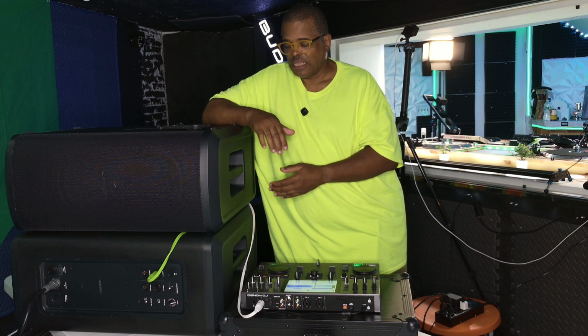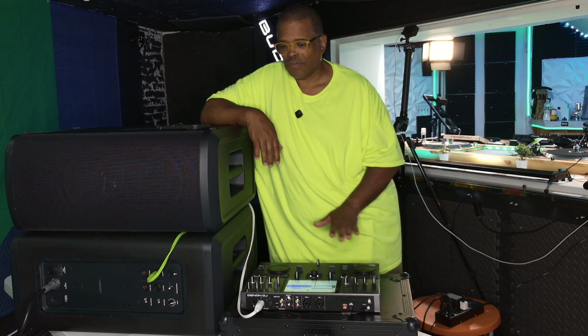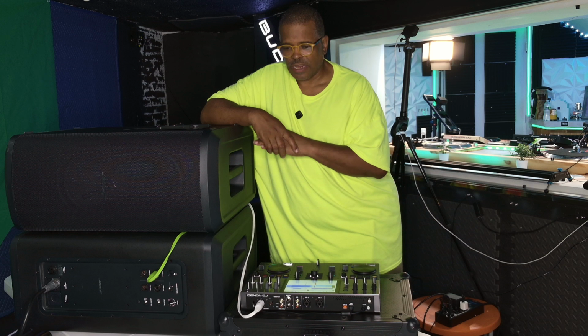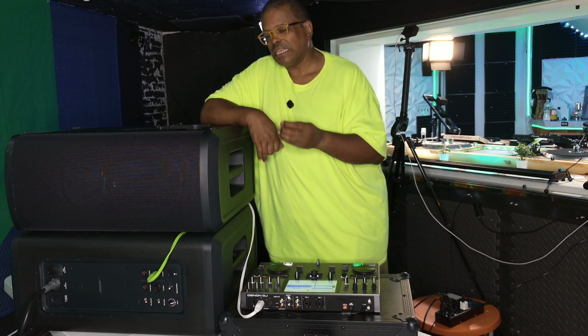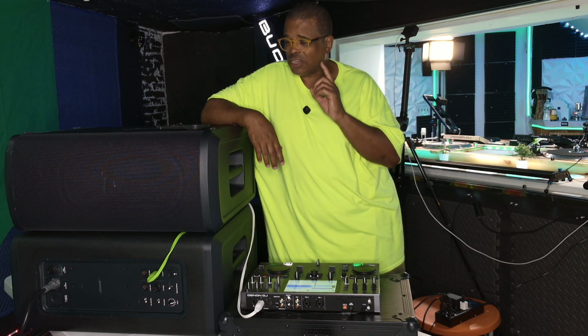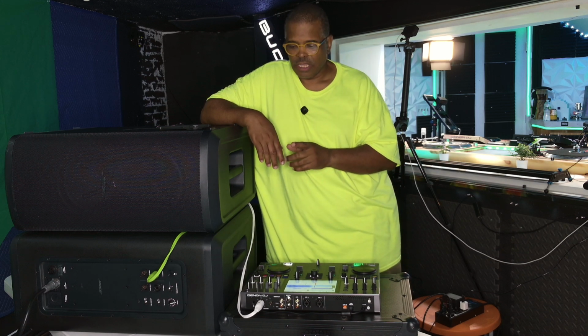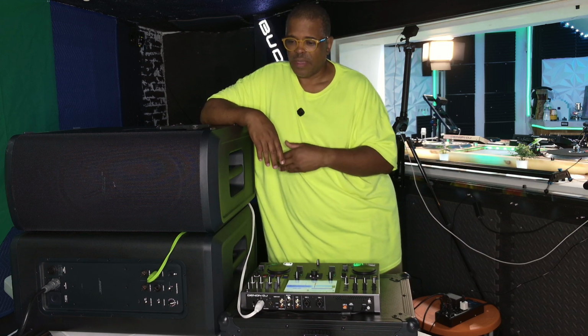It's just that I've been doing the test all on a flat line basis. All of my EQ settings are at 12 o'clock. Nothing is being increased to try to raise the sub level back up. I'm not trying to push it past a certain point. I'm just putting it in and out of cardioid mode so I can see if I can hear those differences, to see if I can meter those differences with a sound meter in the front and in the back.